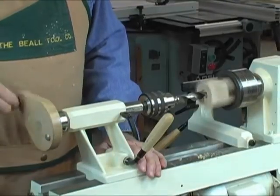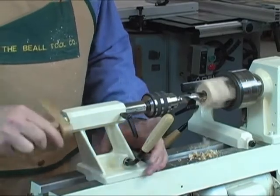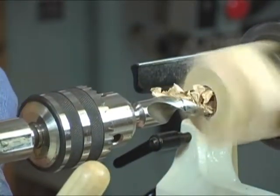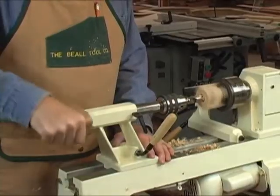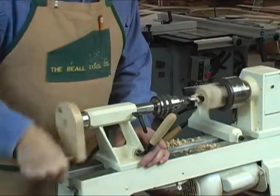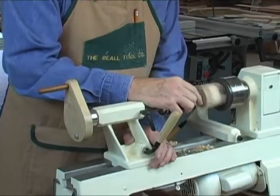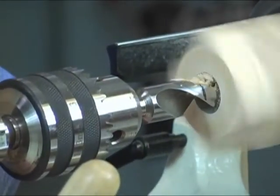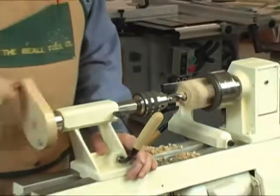I've attached a crank handle to the back end of my lathe. I've done a number of things to this little lathe to class it up — I've improved the handles here and on my banjo, and I've made this nice larger diameter crank handle so that it's much easier to bore. You won't be able to bore all the way in without moving the tail stock because it just doesn't travel that far, so when we get to the end of its range I'll back it out and move the tail stock up to finish. I've made a mark on my drill bit because I know by measuring that I want it an inch and three quarters deep, and when I get up to that mark I'll know it's deep enough.